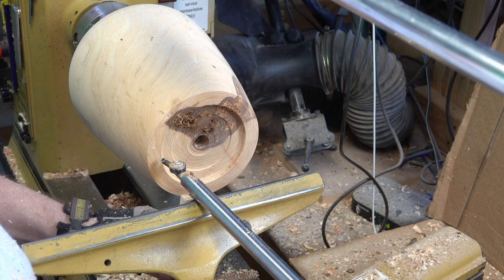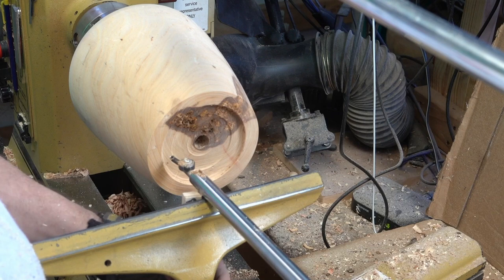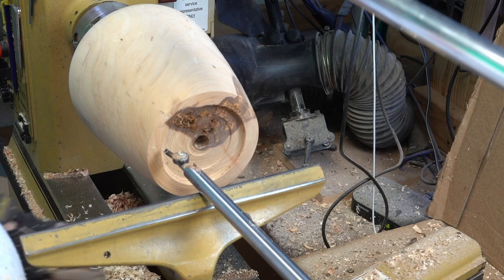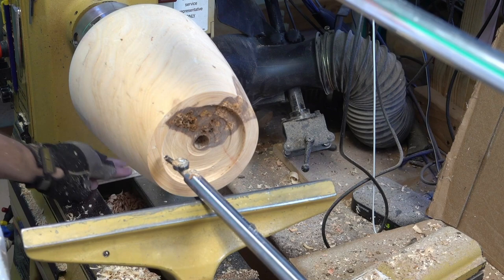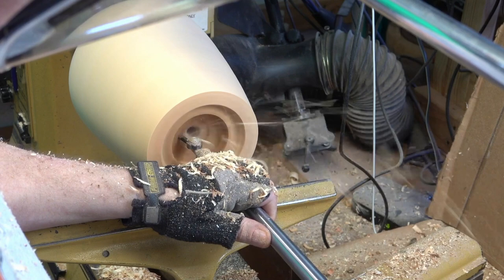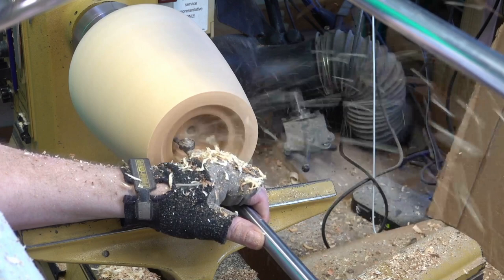Here I've made myself a little wooden gauge to adjust the position of the tool rest and get the cutter on center. I use it to gap the bottom of the tool rest to the banjo — using the thickness of the wood to set the height. I would suggest doing something like that; it's a quick and easy solution if you don't have the adjustable tool rest that Lyle recommends and are using your own. Use a trick of some sort to get your tool rest to the proper height to cut right on center. This shows how easy it is to control and use this tool.